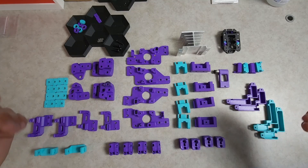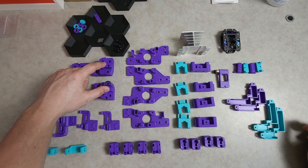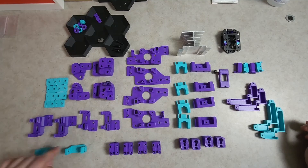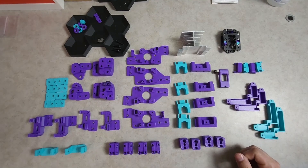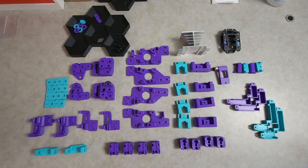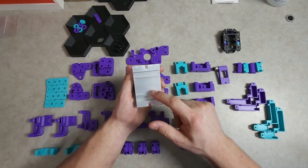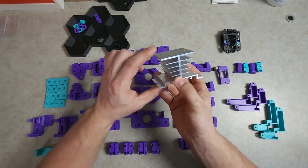Here we have all the parts that came out: the belt clamps, the XY joints, the AB motor mounts, the old Z idlers, the old front idlers, the old Z blocks and joints, as well as the threaded PTFE support arm that came out for the smart filament sensor. Unfortunately, I couldn't get the SSR heatsink to work - it wouldn't fit on the DIN rails correctly, there was no way of securing it, and it was also a little bit too tall.